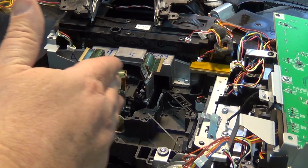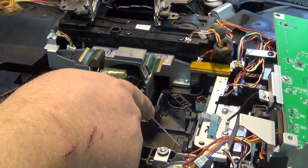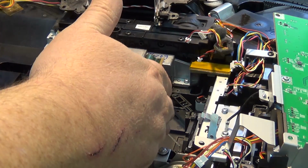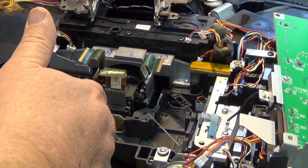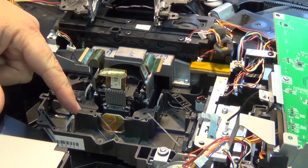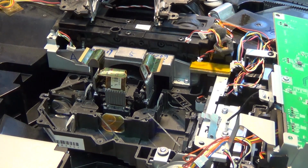The remaining colors, the green and the red, continue through this, it's called a dichroic filter. It's like a semi-transparent mirror. It reflects the blue and it allows the red and green components to pass. At that point you hit the second mirror, which takes the green component and reflects it into the green LCD panel, and the red light continues on its way through this lens, through another mirror, through a lens, another mirror, and finally the red component makes it into the red panel.